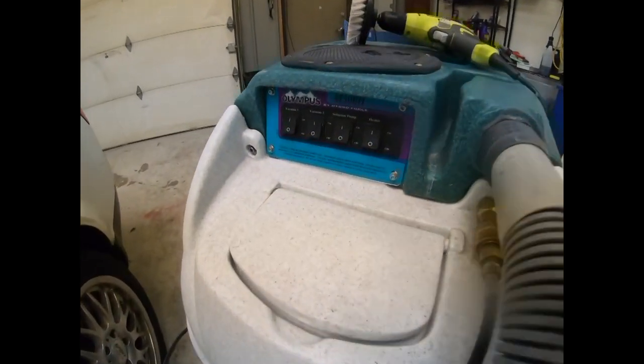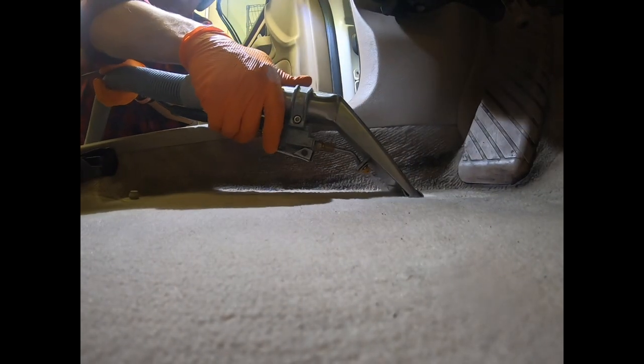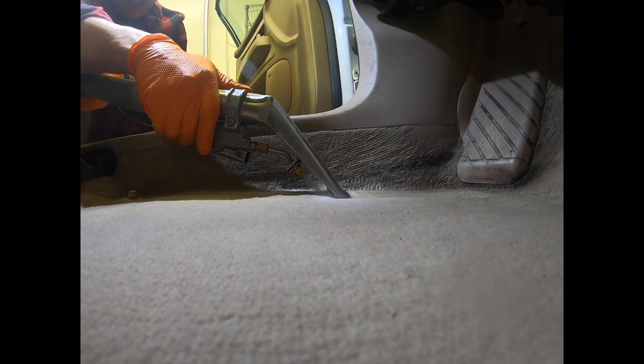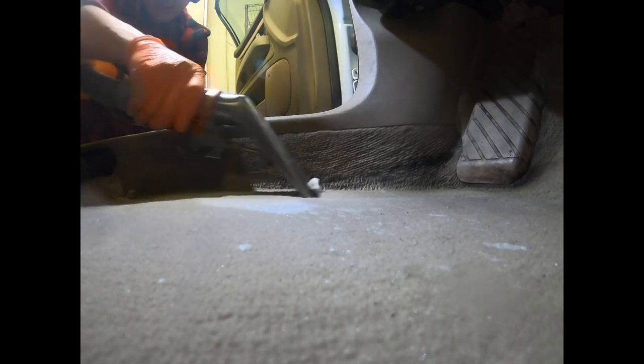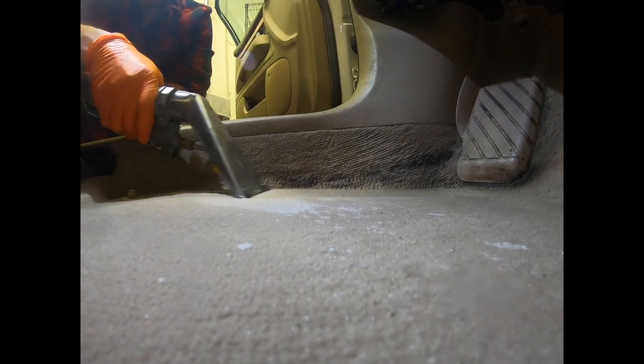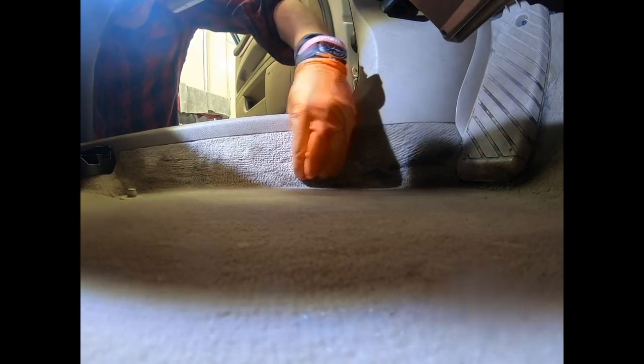Now I'm going to try to extract it. I've got the extractor all fired up here. With urine neutralizer I've already agitated it — what you're trying to do is basically break it up. If your hot water is not hot enough and you haven't been able to break it up, I'd suggest using a steamer. I've got a couple steamers on the fritz right now, so I'm just trying to make it work with super hot water from this industrial carpet extractor. What will typically happen with urine neutralizer is it'll foam up, and you want to extract until you see the foam go away.